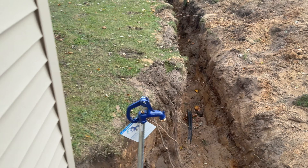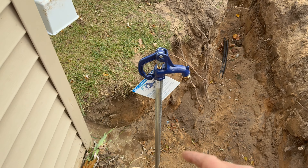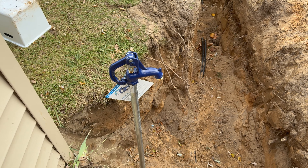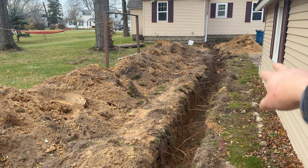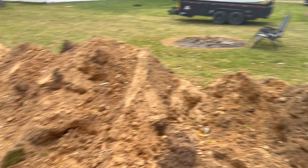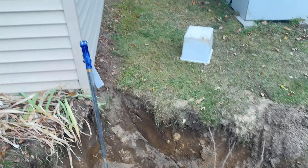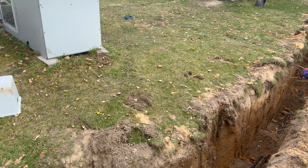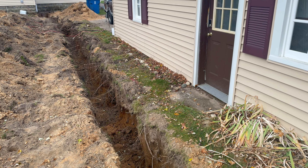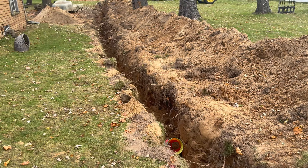Coming to our first faucet at the corner of the garage - a little shorter than I thought. They say they're four-foot bury depth, and we are at about 52 inches, but once we got the block under there I think we're right at 48. The block is probably a three or four inch piece of concrete from the old septic tank. Technically, where I live, three feet is considered enough to be below the frost line, but since the faucets said four-foot buried depth, we made the trench four feet down.